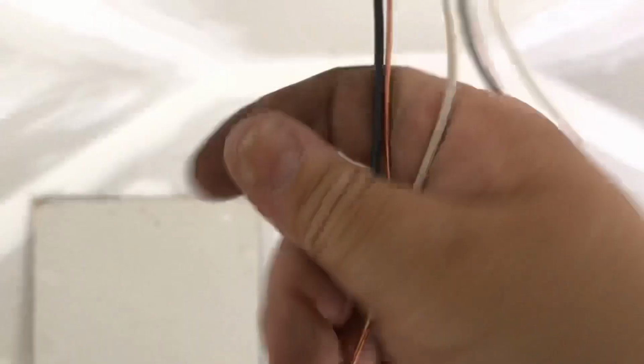All right, now that you got all the ends stripped, okay, let me just straighten these out to show you, okay? You're gonna take your junction box here, which is this guy. Let's start with any one. Start with the ground. I don't have power. Obviously, before I even go any further, make sure the power is off, but this is all new. It hasn't been hooked up yet. So we're gonna take our green and we're gonna connect all the copper wires, which are the bare copper, which are ground. And all you're gonna do is insert them right in and they're gonna lock right in. Mention that there are knockouts here. You see these little holes?